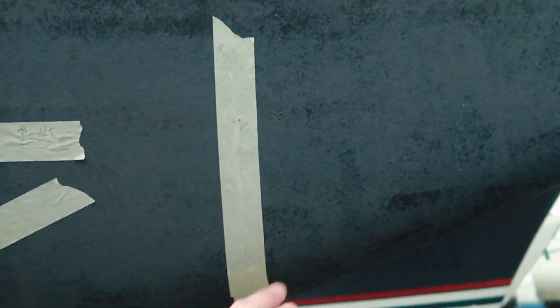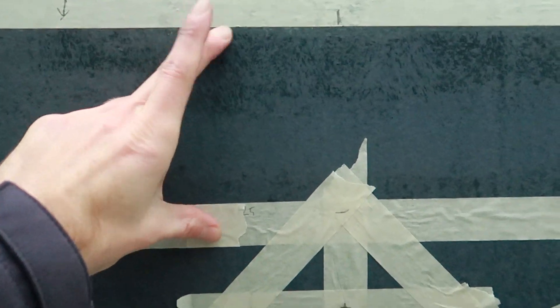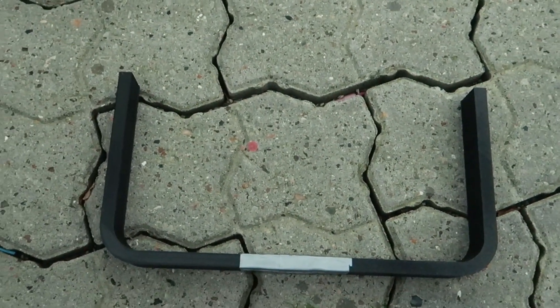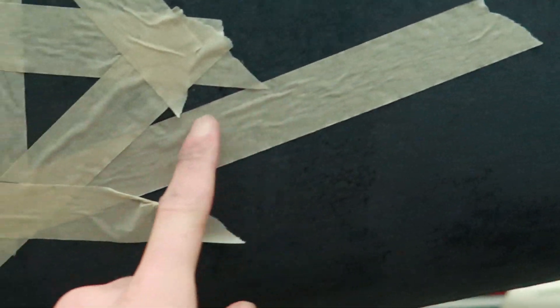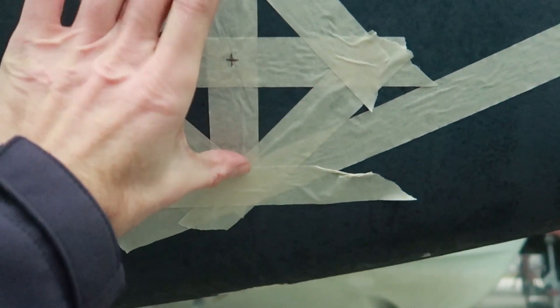Here are the considerations outside. This is the inner bulkhead, the water tank is over here, and this is the front bulkhead. This line marks the waterline, and this point is exactly one tunnel depth — 125 millimeters — below the waterline. You should also have a minimum tunnel width of about two times its diameter, so I have this little 3D-printed guide that spans 250 millimeters. I use it to gauge out where the ends of the tunnel will be. I've drawn a line down here — that limits where we can place it. Given the top level here and bottom level here, that defines our range.